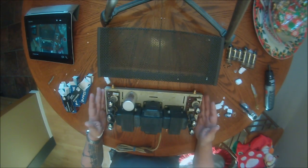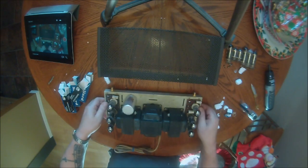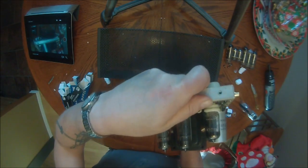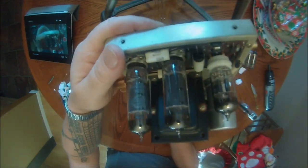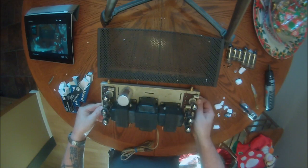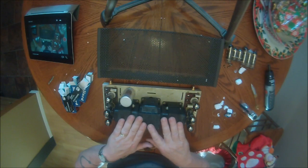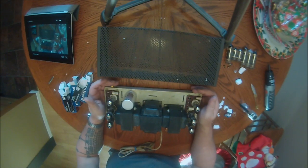Actually, this amplifier is pretty legendary in the amplifier world. For that era, it was a very good quality amplifier. These transformers are well sought after. The original transformers, you can see it says PA774 on the front of it. That's the power transformer. And on this side it says Z565 on the side of that transformer. I don't know if you can see that in the image, somewhere in there behind the tube. But these transformers are highly regarded in hi-fi amplifiers as output transformers. They're really high quality transformers, hand wound in the United States, and these original transformers have a lot of value for vintage collectors.